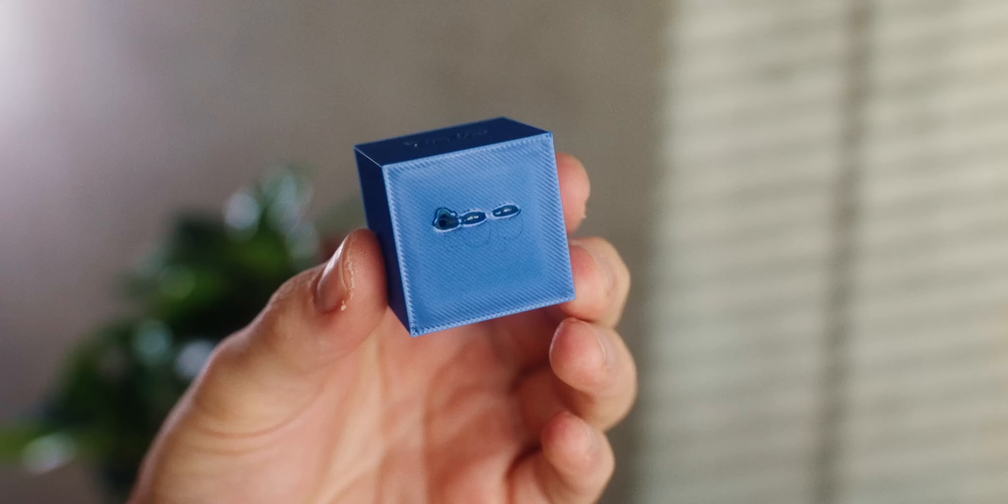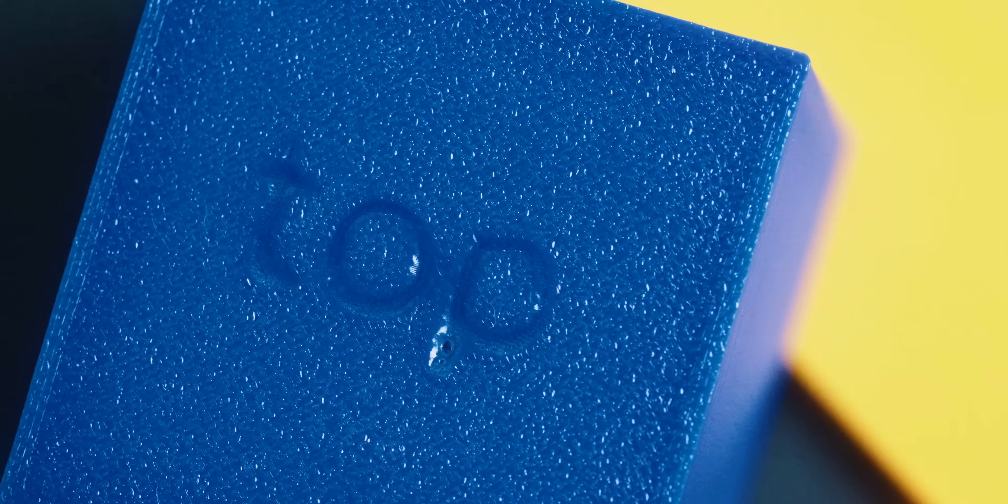After lasering this, you can see a lot of what I talked about before. The hard part is really dialing in the laser. On the first try, I just completely melted through the top or side layers of my cube, which obviously didn't look too great. Then I was still too strong, but in the end I dialed it in. And once I had that dialed in, I really liked the result — you can get really sharp and cool designs. One little extra tip: if you want to do something with laser engraving and get a texture in, it can be really nice to add an extra wall layer or two so you have more depth to laser into before going through the whole outer shell. Once I had the right settings, I also really liked the design that just traces the outlines — I think that's a super clean look. For day-to-day stuff it might not be needed, but if you're trying to sell a product or get the highest quality, a laser really makes the difference.